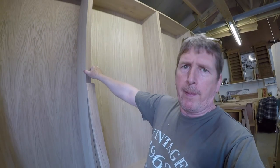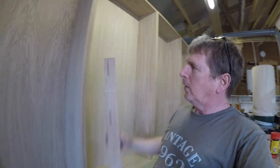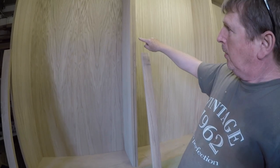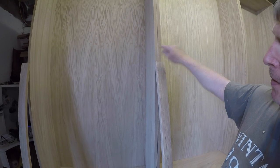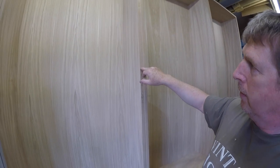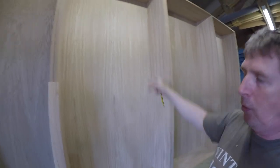This column here — the purpose of the columns is really to hide the joints of the unit. So it's hiding that. I've made these biscuited on one side of the column so that they'll be biscuited onto this face of the carcass. Not this one, this one. So this can get fixed dead onto this, that one can get fixed dead onto that one. I'll do the same with this one — same carcass, I'll fix it onto here. So this carcass will have both its columns fixed on.